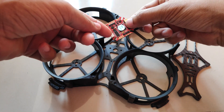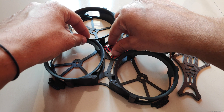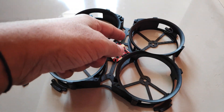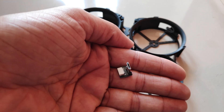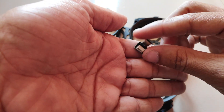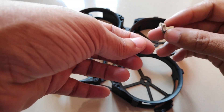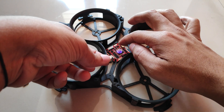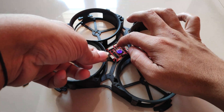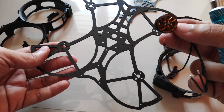Based on the front arrow on the flight controller, I'll have to install it somewhere over here. To access the USB port I'll have to use these adapters that were included in the kit. I thought these were to power up the GoPro camera, but actually I think this will be used as an extension adapter to connect the USB cable for the flight controller. First I'll be installing the motors on the bottom plate.